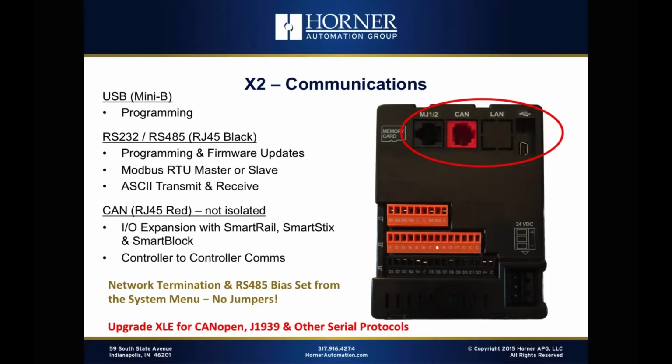But with that RS-485 Modbus RTU master capability comes the capability to control variable frequency drives, for instance, which is a very, very common application in control, even getting down into some pretty low end stuff. So not only do we have analog that could interface with a drive, we can control the drive strictly over a serial port, which frees up that analog for sensors and other apparatus.